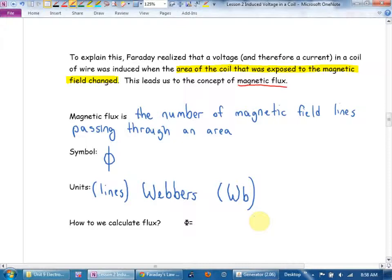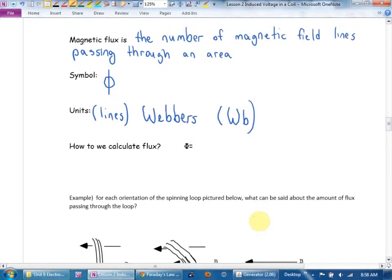How do we calculate flux? Flux depends on two things: the strength of the magnetic field times the area that the lines are going through — but these two have to be perpendicular. A stronger magnetic field gives you stronger flux, and a bigger perpendicular area gives you bigger flux.